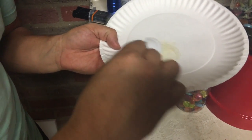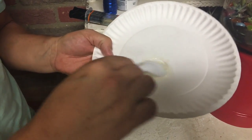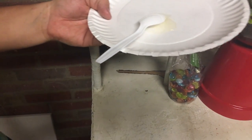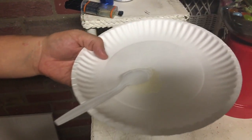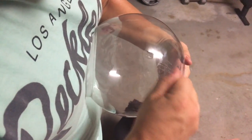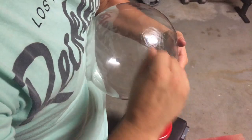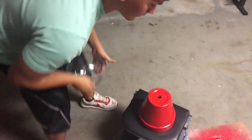Mix it until it's a creamy mixture. It doesn't smell great, but since you're doing smooth surface to smooth surface, just to get a little bit of extra grip, I take a screw — you can use anything sharp — and just scratch up the surfaces you're going to be gluing. That'll make it grip better.